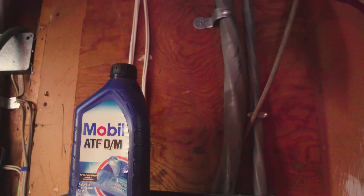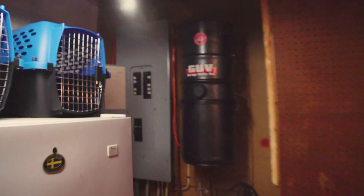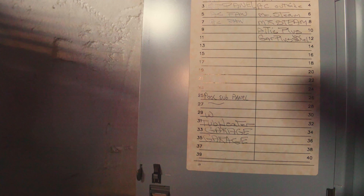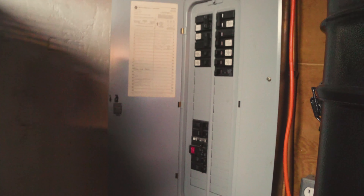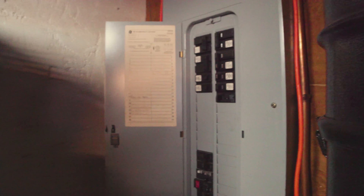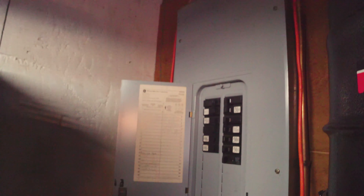Power for the house is coming through one of these wires. It goes through this switching device and then through the main wire again to the main panel over here. This is the new main panel for the house — they have it labeled so you can see pool sub-panel, and garage. So they're powering a panel for the pool and a garage separate from the house. This main panel is now feeding power for the house through a circuit that leads to the defective Bulldog Pushmatic panel. So you'd think they'd have a new panel for the house being fed off this new main panel, but they don't.